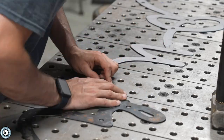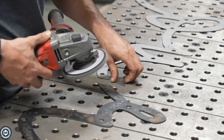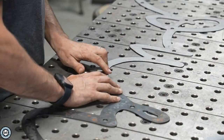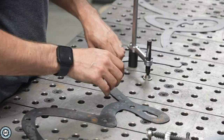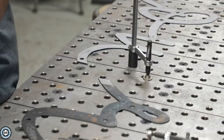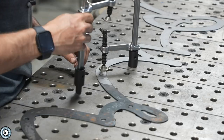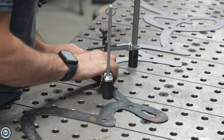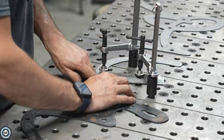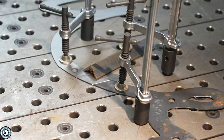I made a small mistake on the first cut — the piece I put on the machine was not actually 48 by 48, and I didn't measure it. Make sure you measure before you start your cut. So I have two welds as opposed to just one, but I'll make quick work of that by beveling everything, grinding, preparing it, and welding it on the table. I'm holding it flat to the tabletop with clamps to tack it in place, and I used a piece of angle to hold both sides at the same time while still giving me room to get the welder in there.